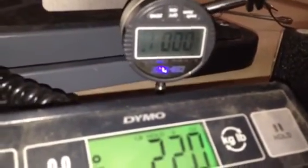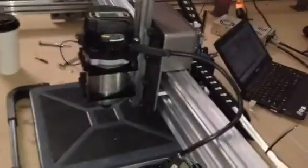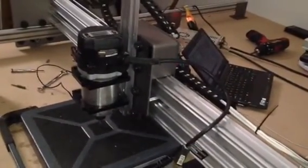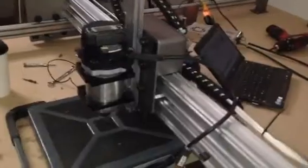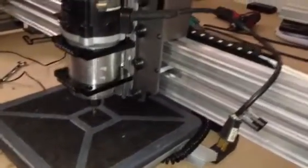32 pounds is the most I get with a thousandth of deflection. Hopefully this will give someone an idea of what they can do rigidity-wise. The only other variable would be cutting further below — more clearance underneath the gantry. If there are any questions, I'll leave the comments open and hopefully I can clear up anything else. Thanks for watching.